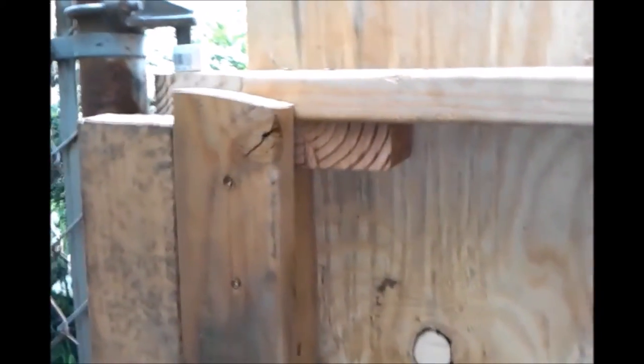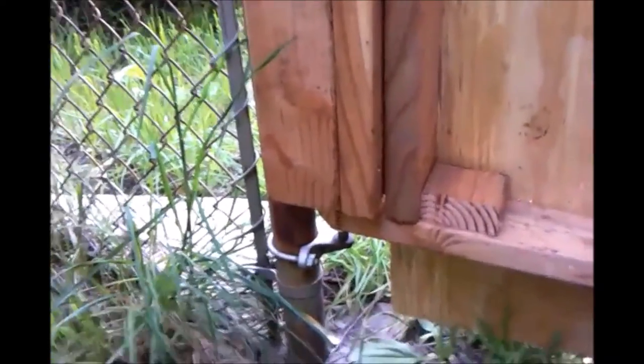You're sizing these pieces on the inside of the top — that's the important part. These side 2x4s fit on the inside and that's what forces it to stay in place so that it catches in the PVC caps. You have to measure the inside frame pieces so that they are long enough to push the top and the bottom frame pieces up into and down below into the PVC caps. It's not really hard — you just have to measure it and get your measurements right.